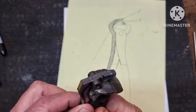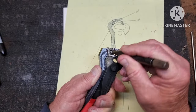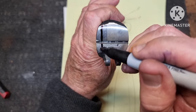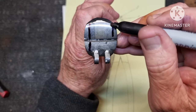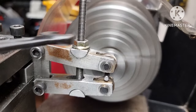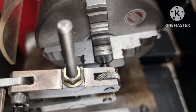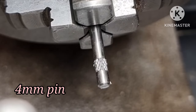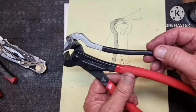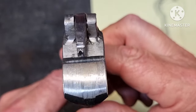Working on the inside of the lever, I got it pretty close and it's time to drill the hole and finish it from there. Before final assembly it's time to mutilate these end cutters to get it as close to the fittings as possible. A neat trick to get your pins to stay in place is to knurl where you want it to jam, and I'm going to jam it into the middle of the lever. I put a couple of pieces of heat shrink on the lever to soften the grip, and a groove on the end to push the wire into the hose.